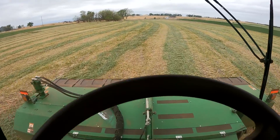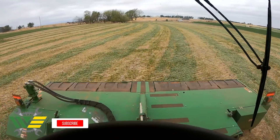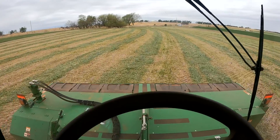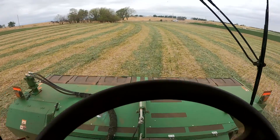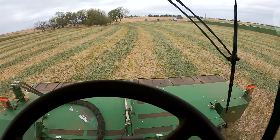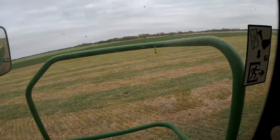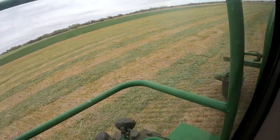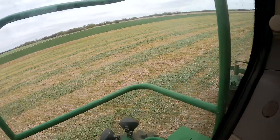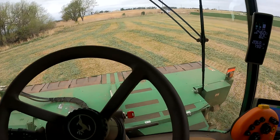What I think is going on is that our rear steer is probably not working on this W235. Our auto track valve is working and engaging, but I think our rear steer — if you can see in the mirror there — our rear wheels don't appear to have any rear steering going on at all. So we're going to take a look at that and we'll let you know what we find.